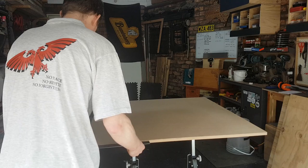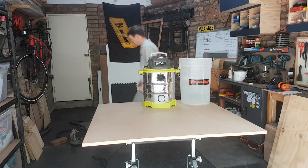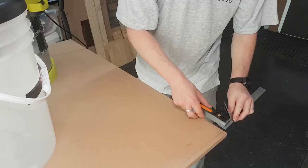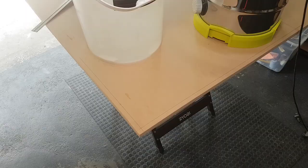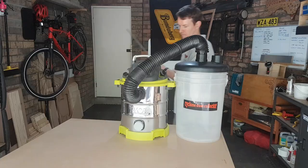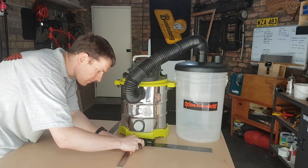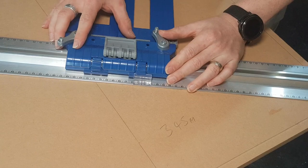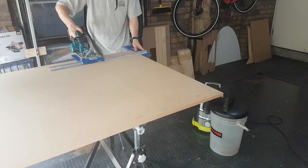I wanted some weight because weight was one of the problems I was tackling. So, 18mm MDF — not really scrap, I thought it was a scrap project, but it's leftovers from when I built my cabinets up on the wall behind me. The 18mm MDF is very, very heavy and it's going to give me the weight I need to keep this stable. Around the sides we're going to have 12mm ply — that was scrap, I got given that for free from some builders. Here I am squaring up around the outside of the vac and bucket.